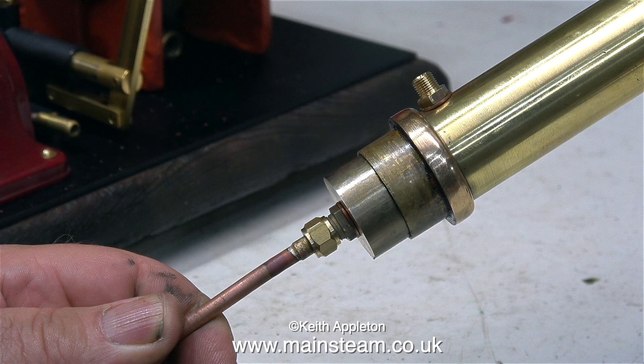Normally on a steam plant you would have a condenser oil trap, which is not really a condenser anyway. It is just there to collect the mixture of condensate and steam oil to stop it going everywhere and making a mess.